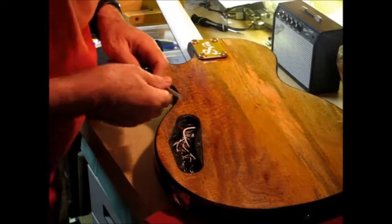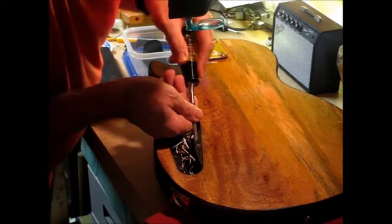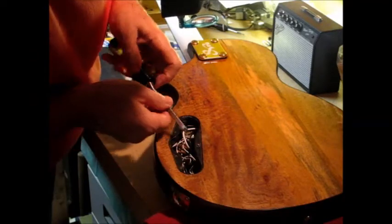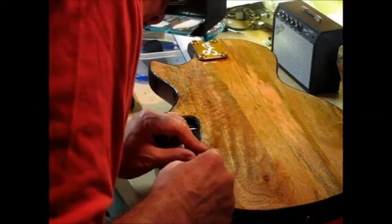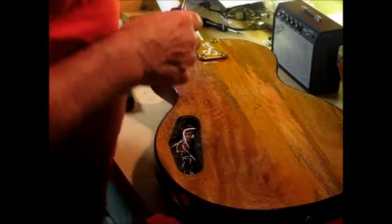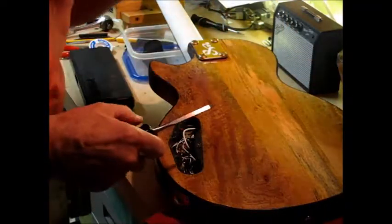Maybe a vice grip, something like that. I've taken a lot of meat out of this area. Hope is that we can get a hold of this. Then I'll do like a quarter inch hole or something that will fit a piece of dowel material. I'll cut the dowel material and we'll use that. We'll bond that in and let that be the receptacle for the screw.